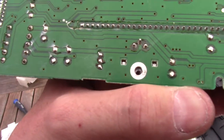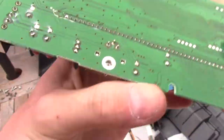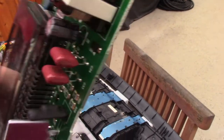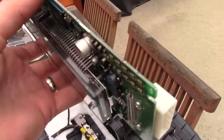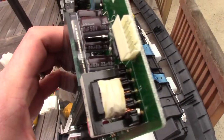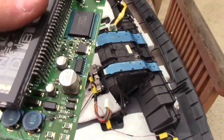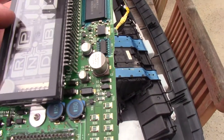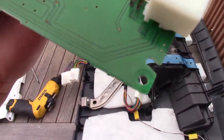I do see a little bit of corrosion on here — that could be electrolyte that's leaking. These film capacitors right here don't go bad — very rare to see those fail — but the electrolytics for sure do. These are good Nichicon caps, so these electrolytics are probably still good. But these surface mount ones, especially the early surface mount stuff, these tend to leak. So I'm probably going to take this to my friend's and use the capacitor wizard.